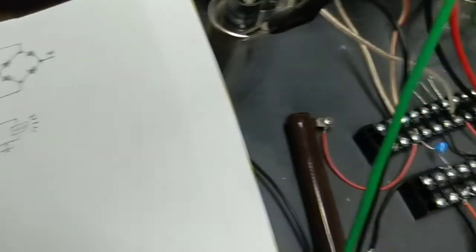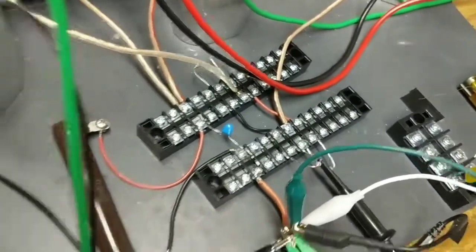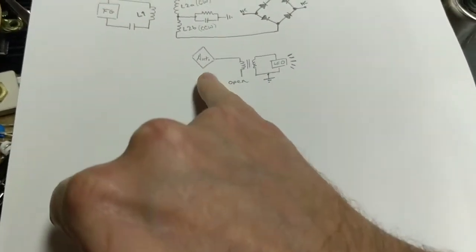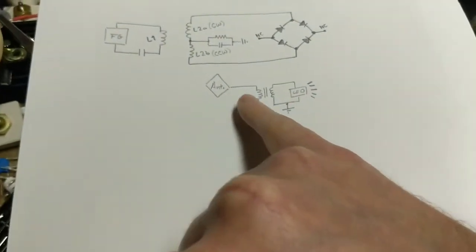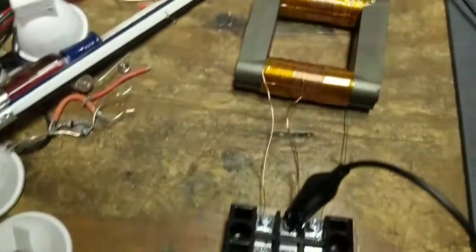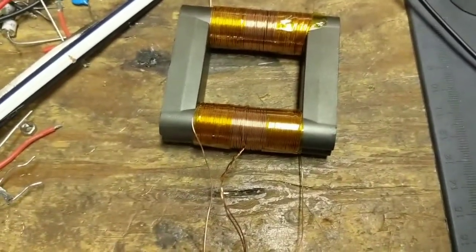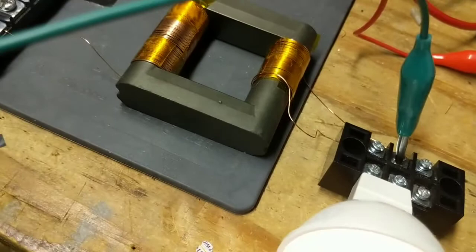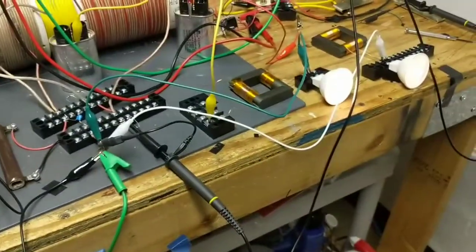And this whole side right now, I don't have anything connected to it, so it's pretty much not even there. Basically on the output side, it's antenna, open transformer, and then the load with the ground side connection. And here, these transformers I've wound. These ones are now center tapped, but pretty much the same thing going on. This one is just not center tapped. It's about a 2-to-1 ratio. And again, this one's center tapped, but they're all producing pretty much the same thing at this point.